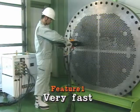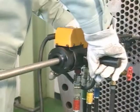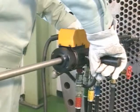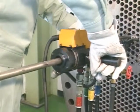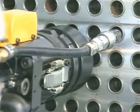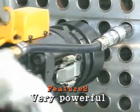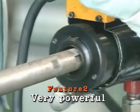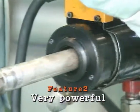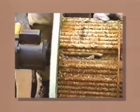Tube pulling starts slowly and powerfully in the initial mode and can be done quickly by moving a toggle switch. This increases work efficiency greatly. The quick puller has a maximum pulling force of 30 tons, making it capable of removing a 50.8 millimeter OD tube. The air blow that comes with this unit allows you to securely pull out tubes with rust or scales on their outer surfaces.